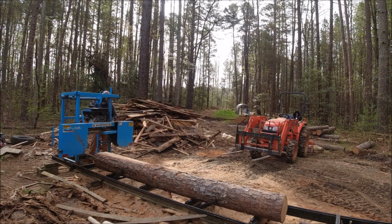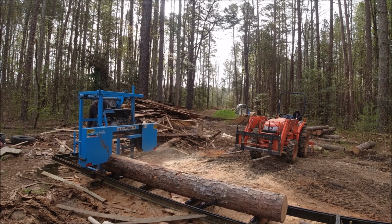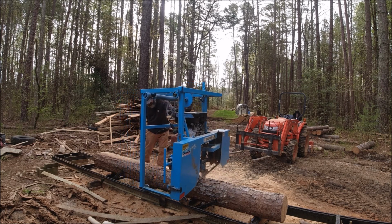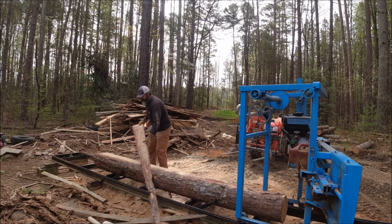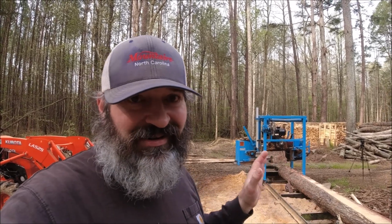We're going to start off at the mill, get some siding done, then we'll take it up to the cabin. Y'all, what I'm doing is live edge siding for this building, and basically all that entails is I'm gonna cut 3 sides into a cant, leaving 1 side live edge, and when it comes time to put these boards up, we'll be able to just peel off the bark, so it'll look pretty neat, overlapped, going up this cabin.